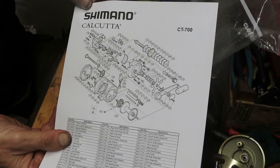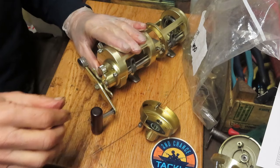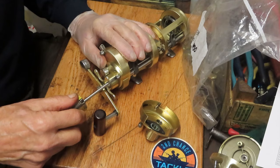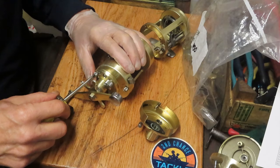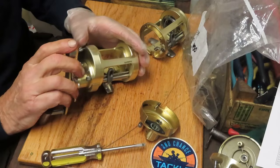This one came from reelschematic.com, and that'll tell you kind of what to look for. It also tells me how to look at the back end of this thing. And then, have a plan. Your plan should involve what you're going to take apart, when you're going to take it apart, and how you're going to put it back together again. I always recommend finding a common ground - start with sub-assemblies and work your way outward. Have a lot of patience and a sense of humor, because we're all going to be laughing at some of this.